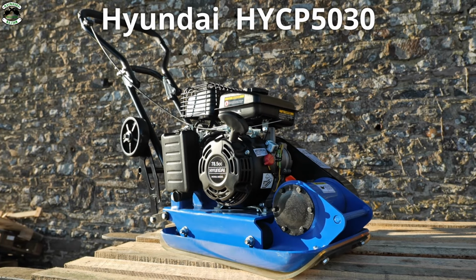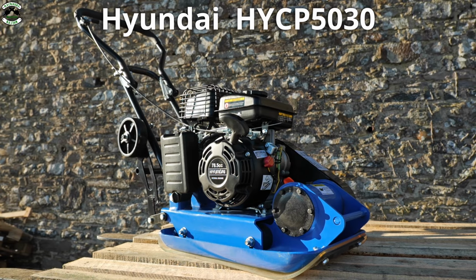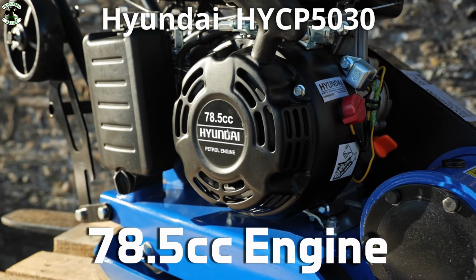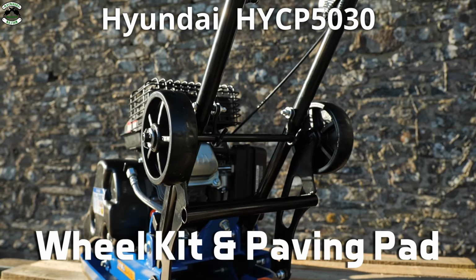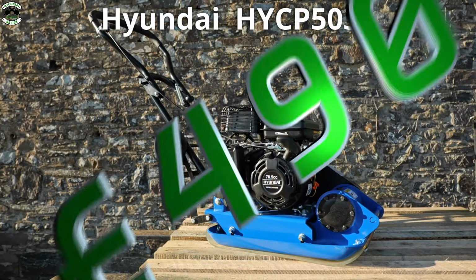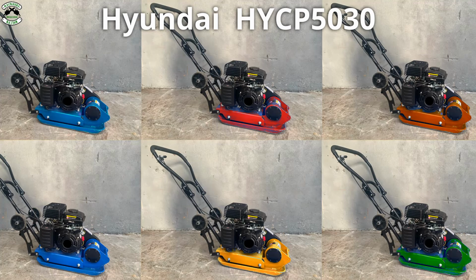Representing the budget end of the scale today, we have the Hyundai HYCP5030. It has a 320mm 12-inch plate, 78.5cc unknown engine, weighs 50 kilograms, comes as standard with a wheel kit and a paving pad, comes with a 1-year commercial and 3-year domestic warranty. It costs us £490, including VAT, and as with many budget machines, it also comes in other guises from other